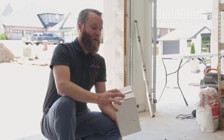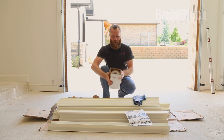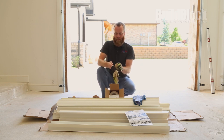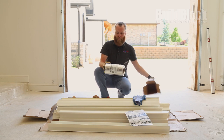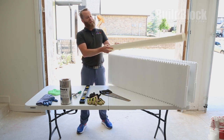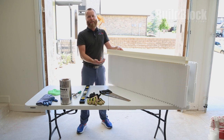This is the adhesive stainless steel barrier. It comes in a roll, and before we pull this out we want to make sure that we put on some protective gloves. ICFs are not a food source for termites; however, they can burrow through the foam. The BuildShield provides a protective barrier that will stop them from penetrating through the foam. It then forces the termites to the outside where you can see them and then treat them effectively.